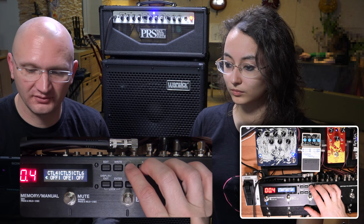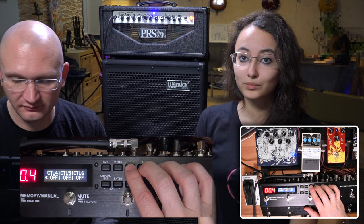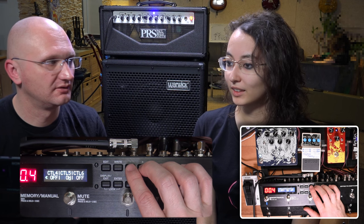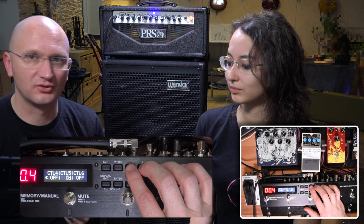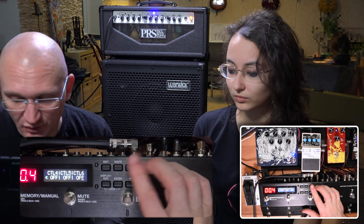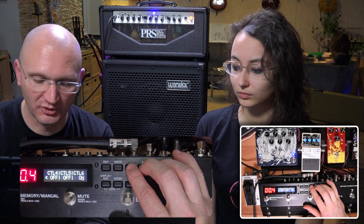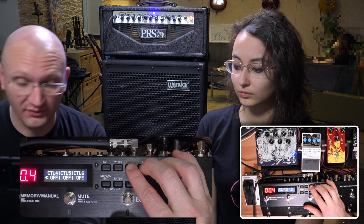So we're going to try inverted now. On/off actually does on/off — well, off is on and on is off, but I can live with that. It's a little confusing but you can deal with it. Every time I'm sending an on or off signal to control 6, it's going to go to the next preset — off: blue, on: green, off: red, on: blue, off: green, on: red. You get the point. The problem with that is that off doesn't mean a certain preset, and on doesn't mean a certain preset.